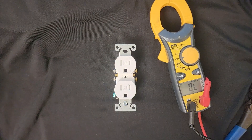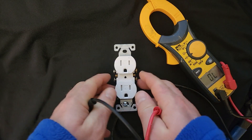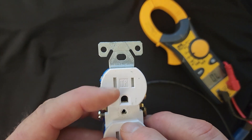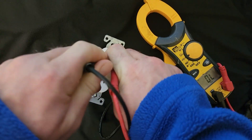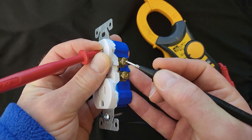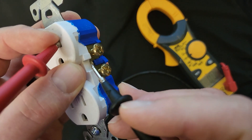If we take our electrical voltmeter and put it on an audible continuity setting, we're going to test how all three of these are tied together. First, I do want to note that this is a TR receptacle — meaning it's tamper resistant. You can see these little shutters inside there; they're the same color as the receptacle. Before I can stick into any one of these terminals I have to stick into both of them, or the shutters will not open. Once I get it open I can go from here to the hot terminal and that will give me audible continuity, letting me know that those two are touching internally.